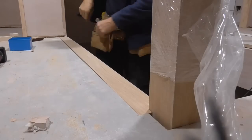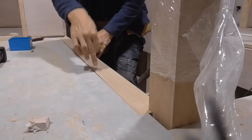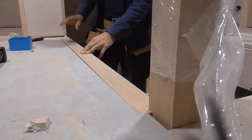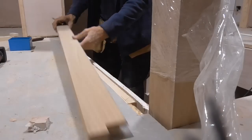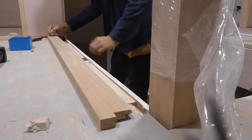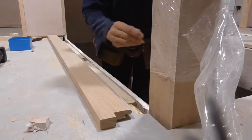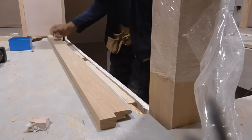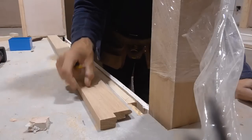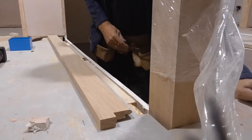Beautiful. And we can screw that straight down into the end of the joist and the noggins that I put in here before I put the plasterboard on. So that's absolutely superb. Measurement-wise, we're going to go there, I reckon. We'll go one there, one there, and one there. We'll go somewhere in the middle. As long as these screws are set back far enough so that the spindle capping rail doesn't catch them, they won't be seen.